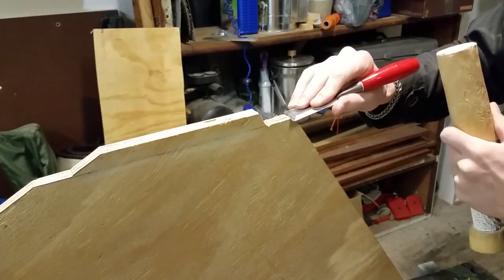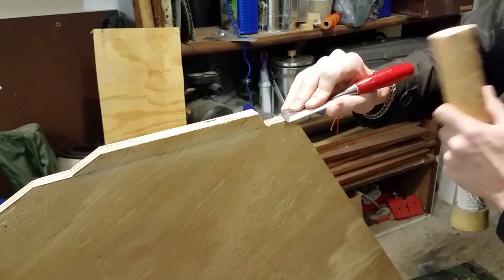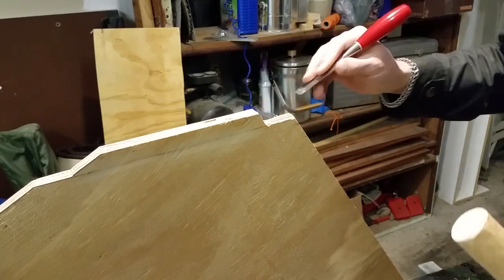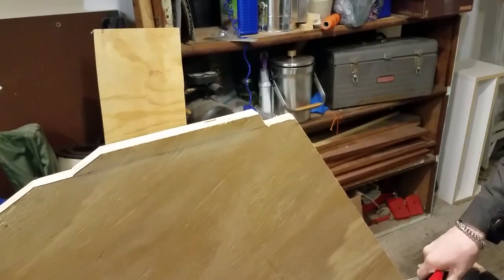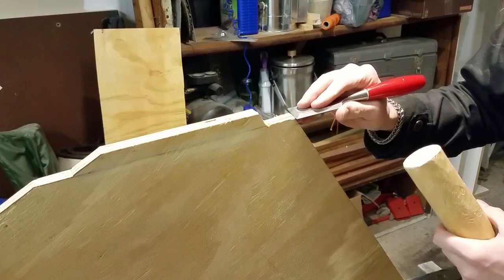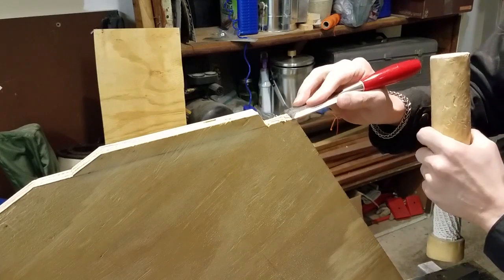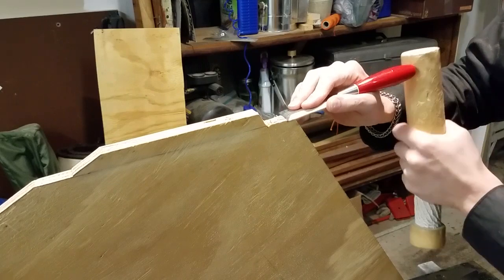Someone's going to say, buy better chisels. And I'm not going to do that, because I'm going to blow several hundred dollars on marine plywood. Also, I didn't say it before, but you should sharpen the iron in your plane constantly, especially when you're messing with plywood, because plywood dulls stuff. It's got layers of glue, and you're going across the grain.